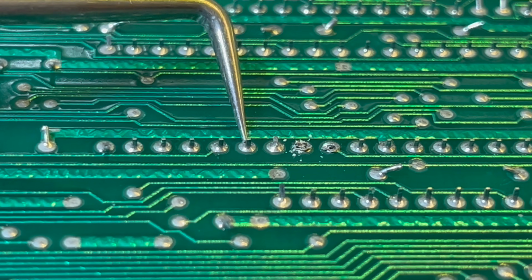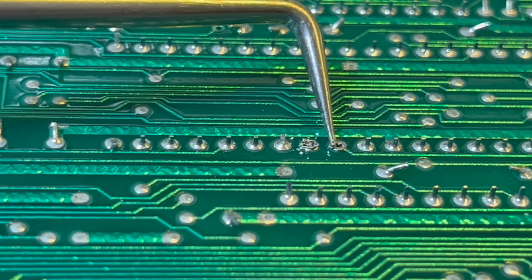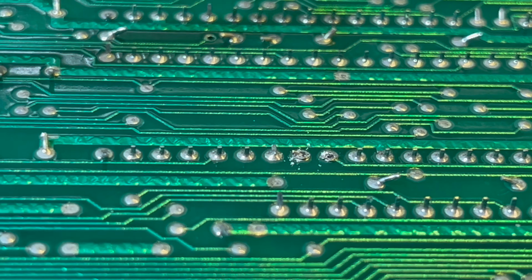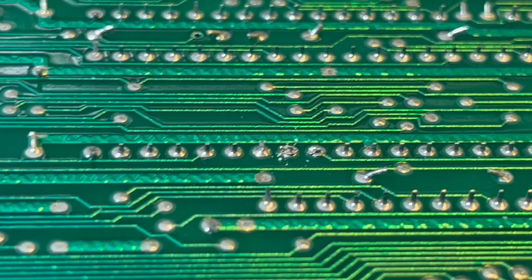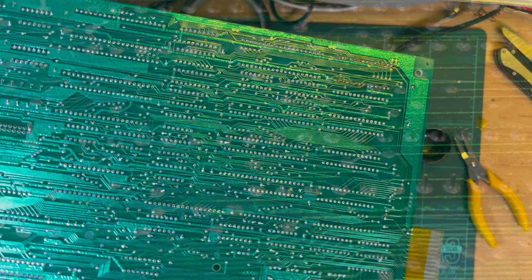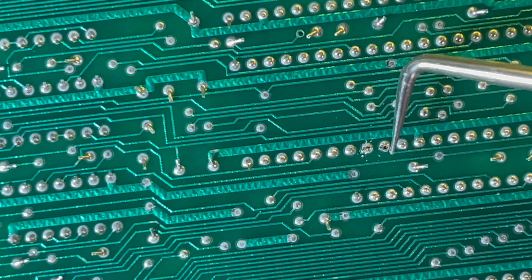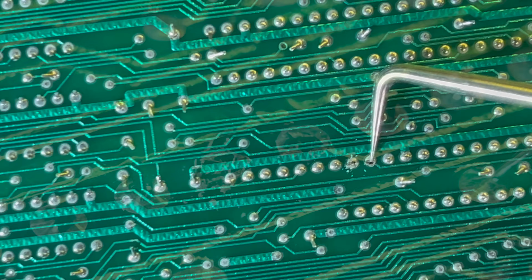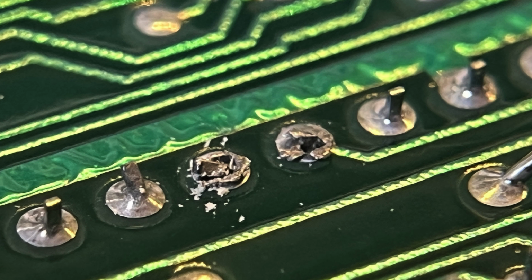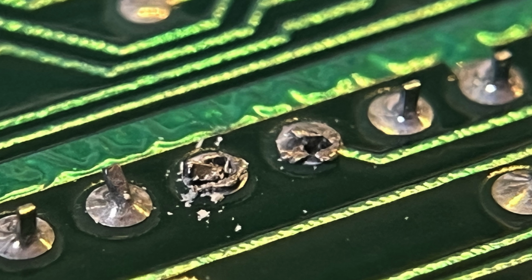So it's like the solder is kind of a bubble, because it's kind of broken. This pin here is actually wobbling. Sorry, like my arm is. Hang on, where's my little stand? I'm going to have to use the overhead again. I think it was these two. So this pin is loose. So I think that might be why sticking it into the bottom case makes it fail.